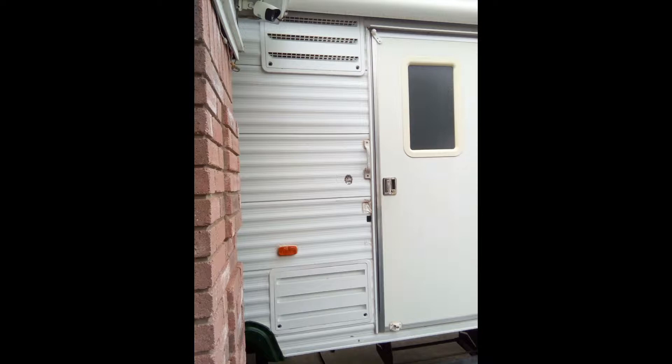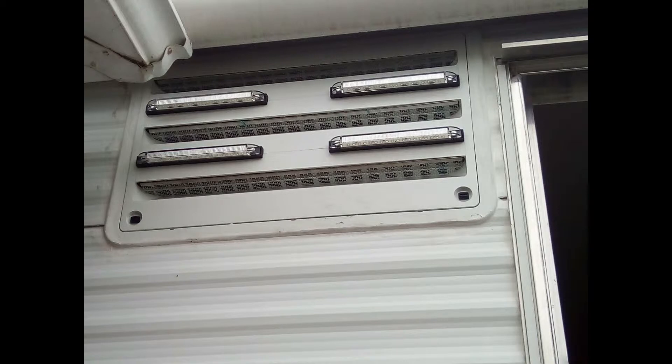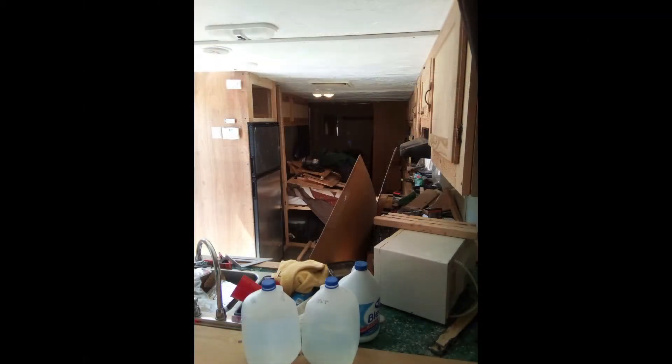The first thing I had to do was cut the vent holes in the trailer for the lower and upper half of the fridge, because these fridges create a lot of heat that has to escape. The vent happened to take the place of where my outdoor light was, so I had to replace that — I put LEDs on the vent itself. The vents can be found on Amazon or any RV place; they're just Dometic vents and come with instructions. That was a piece of cake.